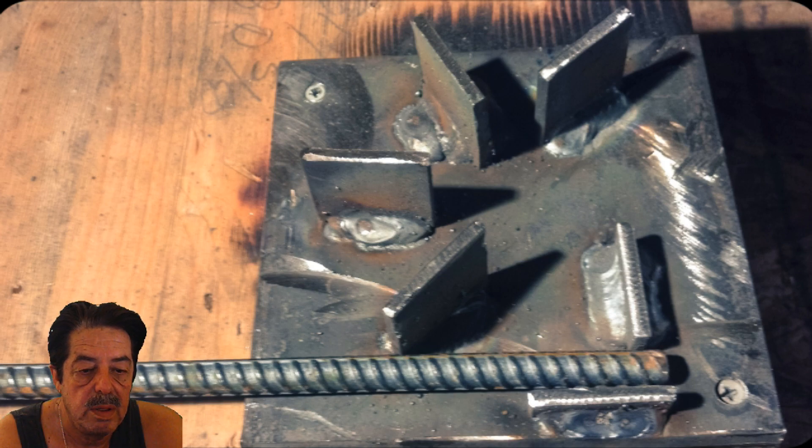You're going to put some force on it when you heat the steel and bend it. On the opposite end we put a small pipe over that half-inch round bar stock, and as we heated it we just kept walking and bending it. It came out in a nice smooth arc all the way around. We did a complete circle, but you don't have to — you can also do a quarter round or a half round with this same setup.